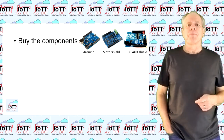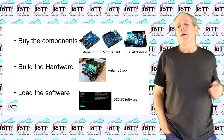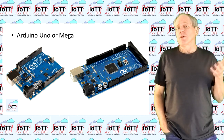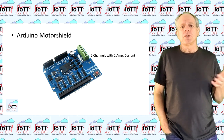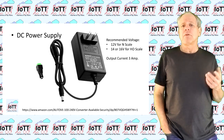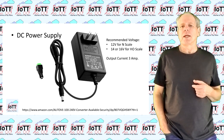Building a command station consists of three phases: buying the components, building the hardware, and loading the software. Here are the components you need to buy for your build. An Arduino board, either Arduino Uno or Arduino Mega. A DCC AUX Shield to simplify the wiring. A motor shield to power the track. And a DC power supply with the track voltage needed for your modeling scale. Good choices are 12 volts for N scale and 16 volts for HO scale.